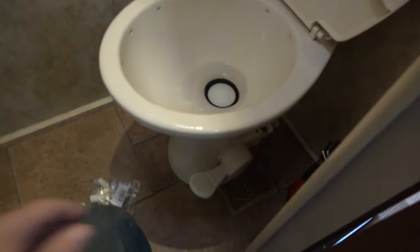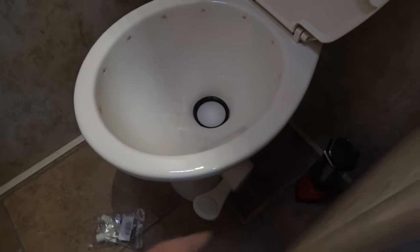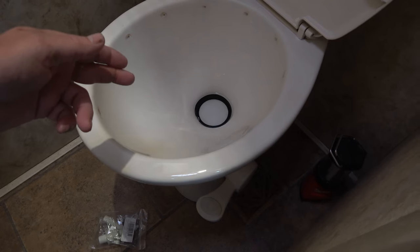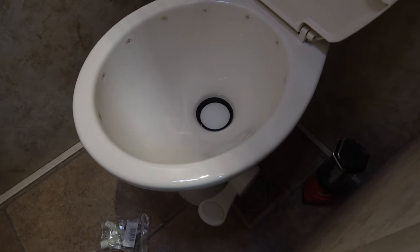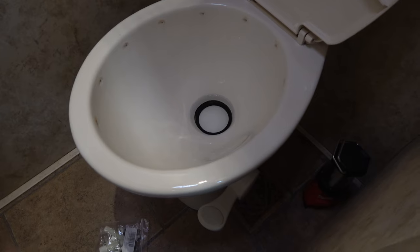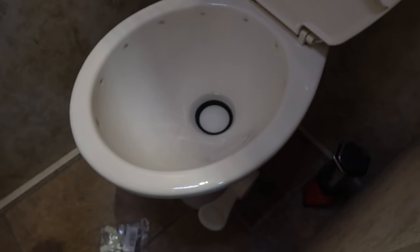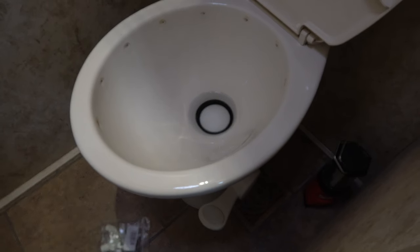No problems other than lately it's been filling with too much water. These things are designed with a foot flush. You flush it and when you let go there's a valve that's supposed to close and let a little bit of water in, but it's been weeping more than normal. Suddenly I'll look at the bowl and there's half a gallon of water in there, and when we're off grid that's not good — I end up filling my black tank too quickly.